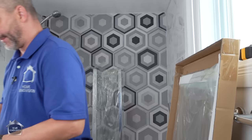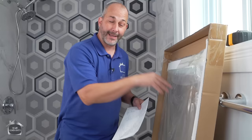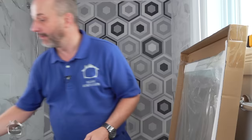I imagine all of the doors that are like this have similar styles available. Some of them are as low as $130 on Amazon — we'll put some links in the description. They're simple — they're six mil glass, so they're not that heavy. You can buy eight or ten mil glass, but that stuff gets really heavy. They all install basically the same way. You need to have a nice level line, and hopefully your tub is somewhat level as well. After that, just a couple of adjustments and you're done.